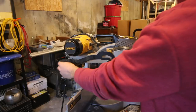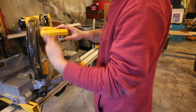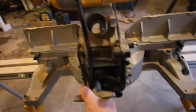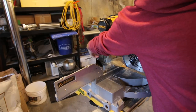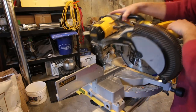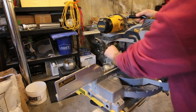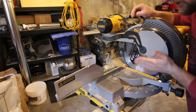This is a miter compound saw, so it'll cut angles both to the left and to the right. On the back side there's a handle to unlock so you can do your miters — loosen the handle and you can adjust up to 45 degrees. There's also a pin on the back; pull that out and it'll let you go the other direction as well. Every time you go to use your saw, you should make sure you zero it out up and down and side to side.